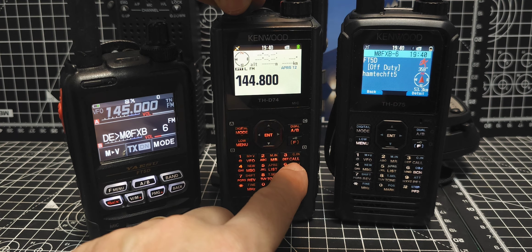The way you set those addresses — not that we're going to use them — but if you go to P4 and hit the F button, it takes you back and you can start entering addresses. This is something I've never done: WIDE1, WIDE2. So you can manually enter them, but they've preset one and two for you to make it a lot easier.